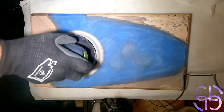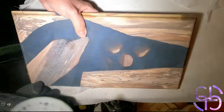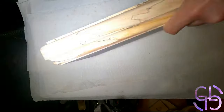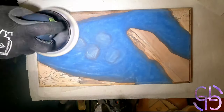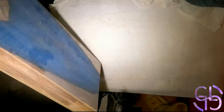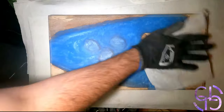With the board shape ready, it was time for my favorite activity — sanding! I started at 80 grit and sanded all the way to 2000 grit. I've noticed that with epoxy you need a lot more sanding in order to bring out that shine and whatever's inside the epoxy. Wood looks pretty good at 800 grit, but with epoxy you need to go to 2000 grit or it will end up looking cloudy. After each grit, make sure to wipe the board thoroughly with a paper towel to remove any leftover epoxy dust. I do love sanding, but with epoxy it just doesn't feel as good. When I sand wood I pay attention to it and try to see its story. When I sand epoxy, I'm sanding a piece of plastic. Not to mention sandpaper becomes useless quicker when sanding epoxy versus wood — pretty much after I'm done I throw out the disc, whereas with wood it can last about 4-5 sandings. Still allowed me to get into a flow state, so I guess it counts somewhat.